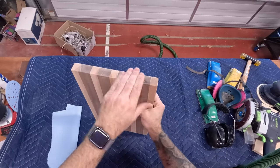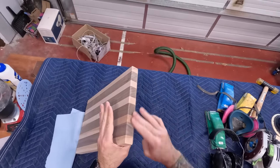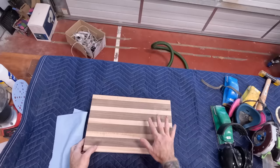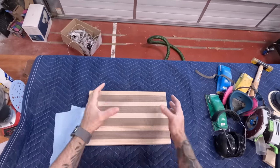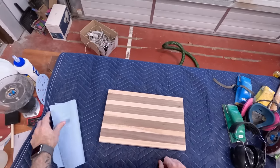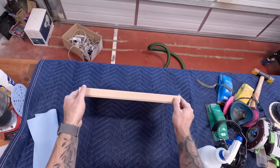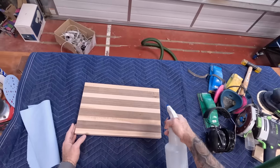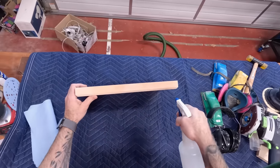Everything is pretty well sanded. I actually did sand the end grain up to 220 — I like to go one grit higher than everything else on the end grain just to keep the color from getting too much darker than the rest of the piece. Now it's very tempting at this point to just hit this with your preferred oil and call it done. But as soon as someone goes to use this cutting board and it gets wet, there's a good chance that even after oiling you're going to cause the grain to raise. So there's one way we can combat that — giving it a pre-treatment of water. I'm going to spray it down and get a nice little preview of what that might look like as a finished board.